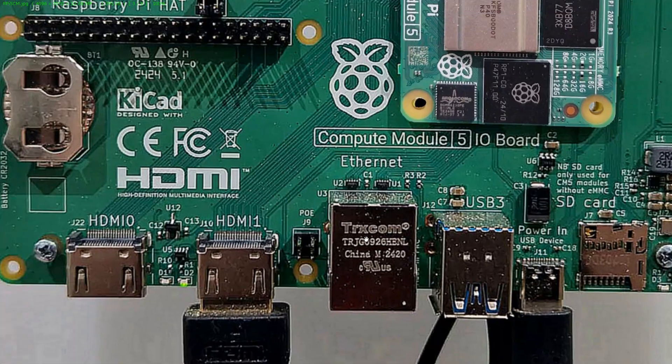An alternate way of powering your Raspberry Pi is Power over Ethernet. You need an adapter which connects here — these are 5-volt input pins, and of course you have a number of ground pins here. You need a voltage converter to get 5 volts, because there are no 5 volts on Ethernet. Ethernet can be powered or unpowered, so you get the raw power from Ethernet if it's PoE-enabled. You still need an adapter just like for Raspberry Pi 5. I don't think the adapters for Raspberry Pi 5 would also be usable for the Compute Module 5 IO board.